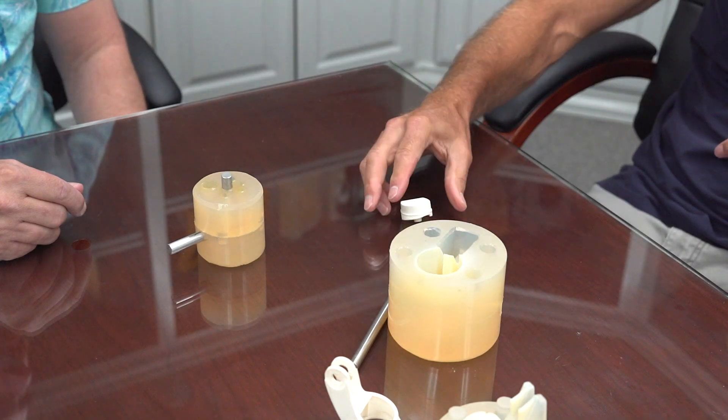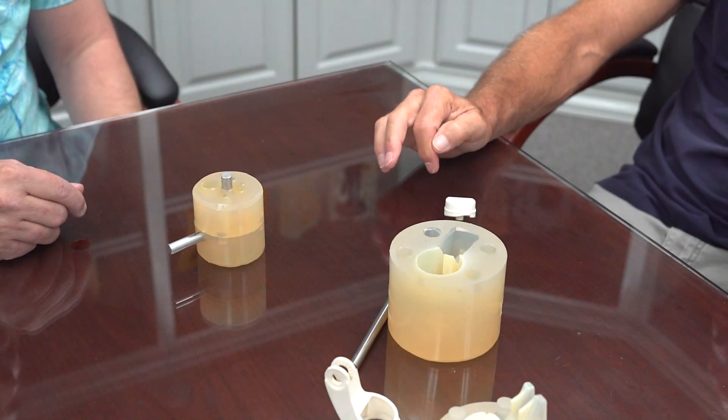How do you prep a part like this for molding — and let me qualify this because this is specific to how John would prep it for the 50-40 or the 50-41 we had in some other videos. So how would you typically prep that SLA pattern for making a platinum mold? I like to use a gray primer, like our SEM high-build primer. I do the filling, sanding, and things like that. Then I'll do a final coat and maybe lightly sand it depending on the finish. Sometimes I'll spray a texture on if I want a textured finish. A lot of times it'll just be a light sanding — make sure I don't break through to the SLA, because sometimes that can be a problem. I'd rather be safe, so have a nice coat of either primer or we even have a SEM clear coat that works as well. If I want a high gloss level, I'll spray that and not touch it — make sure it cures maybe overnight before I pour the mold.